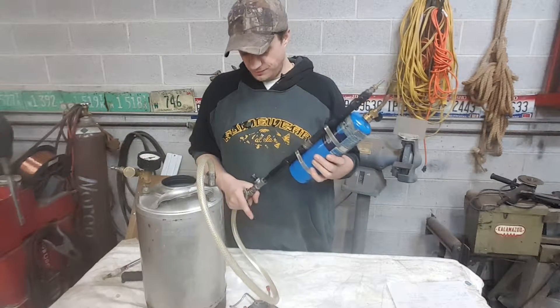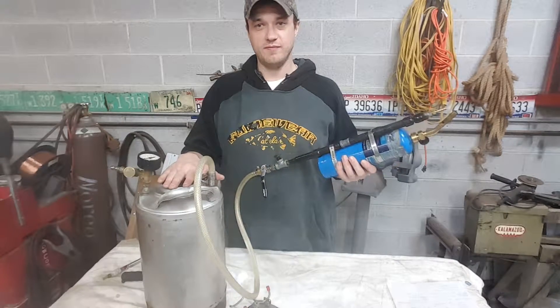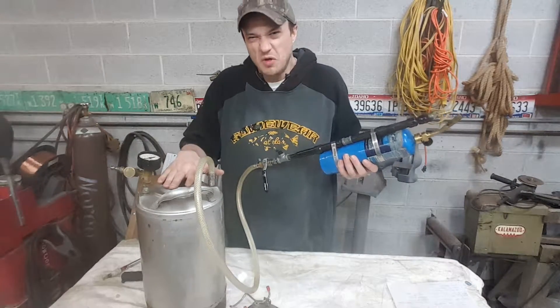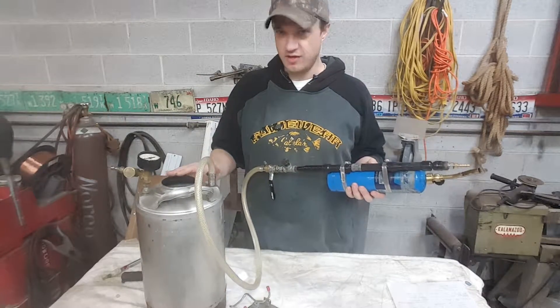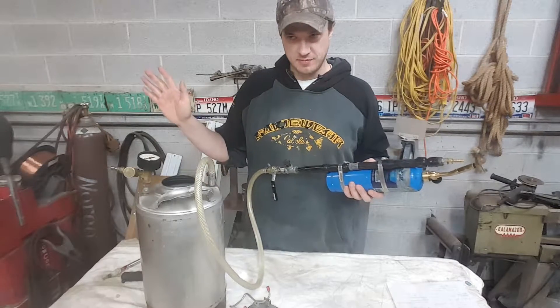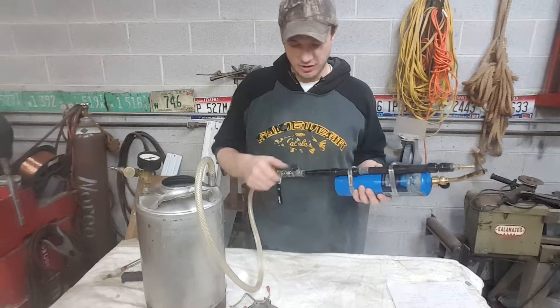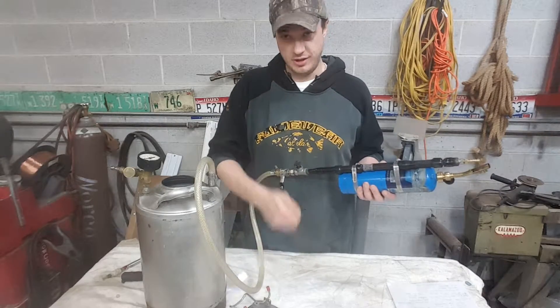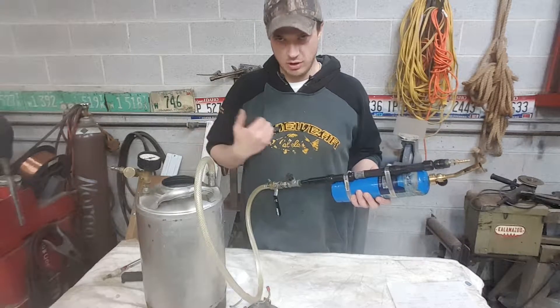This thing I built just to use diesel and kerosene for the most part. The reason I do that is diesel and kerosene are not volatile — you have to atomize them before they'll really ignite. You could hold a lighter to a puddle of it all day and nothing much will happen. It might burn just a little bit like a candle, but that's not going to cause anything to blow up.